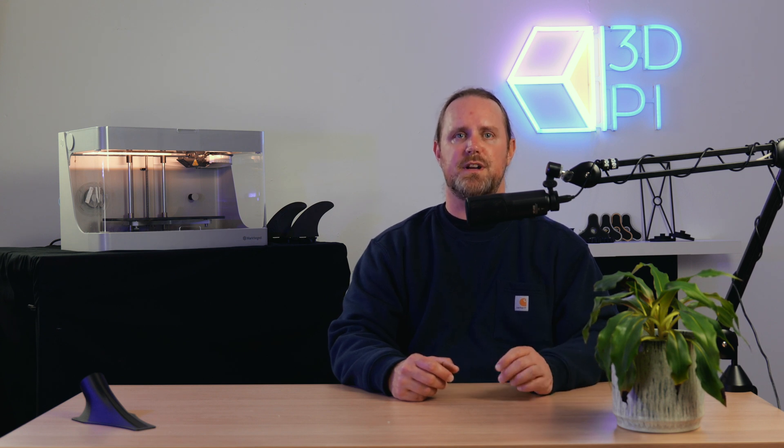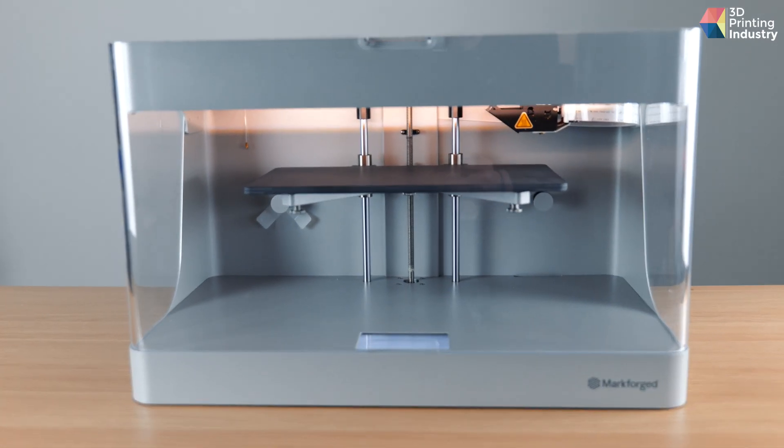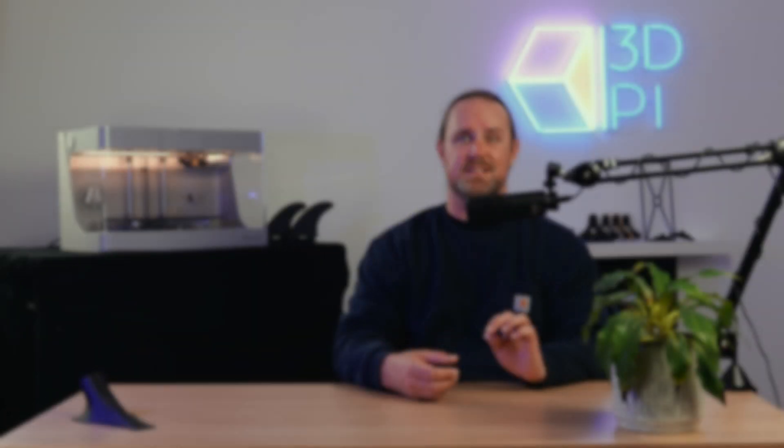Using chopped carbon fiber adds lightness. However, the continuous carbon fiber from the second nozzle ensures the 3D print is also strong, adding continuous fiber reinforcement. The Mark II is engineered to deploy CFR in an optimal manner. The sleek metal chassis gives off a minimalist vibe, belying the versatility of this printer. Weighing in at only 16 kilos with a maximum build volume of 320 x 132 x 154 millimeters, there's little to hint at the punch the Mark II packs.